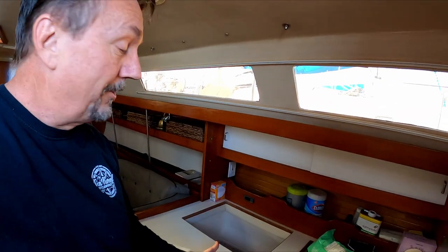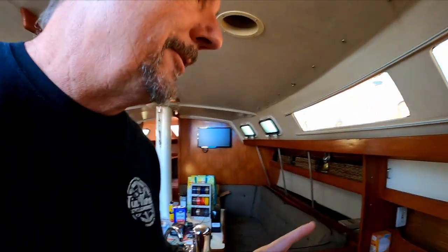The interesting thing is this refrigerator, which is really effective but not efficient, will use my battery so fast that I can't afford to run it going to Hawaii. The water will be warmer in Hawaii, and that heat is going to rise up from the hull and just heat this thing up. So my refrigerator is trying to keep my boat cool and that's not going to work. What are we going to do to fix that?